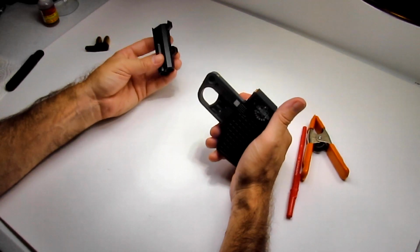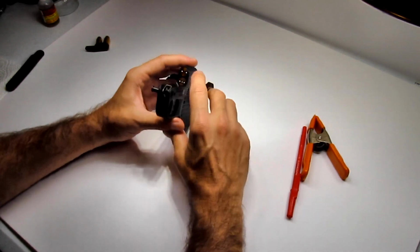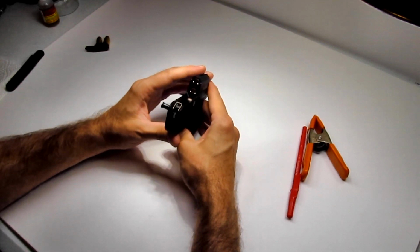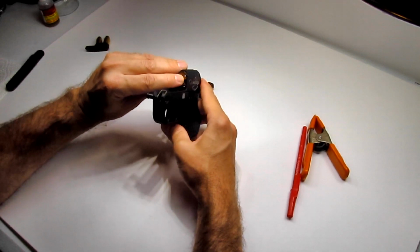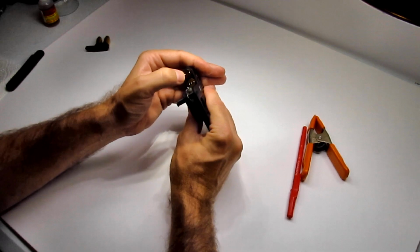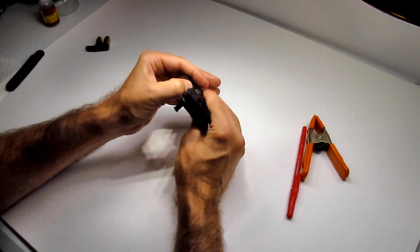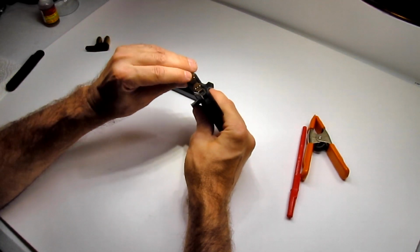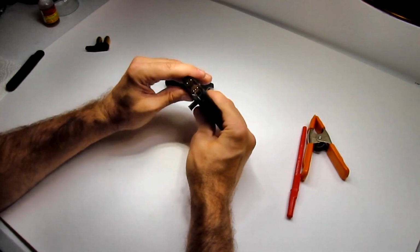Okay, replacing the barrels. Well, I should tell you a little bit about the frame. The frame, this is basically your upper firing pin and your lower firing pin. It looks like they've got some anti-wear inserts for your breech face. And then on that breech face, you've actually got two ball bearing detents. So basically they're ball bearings being held in from the opposite side of this retention plate that holds back the firing pin and these ball bearings.